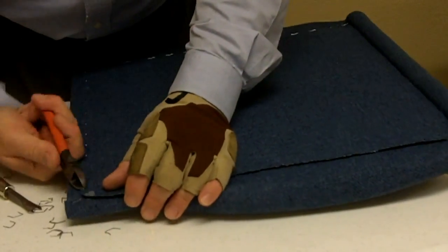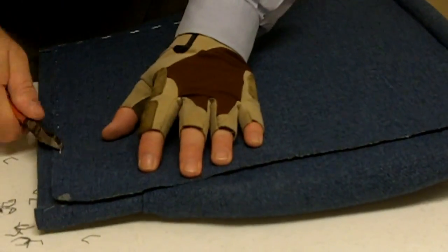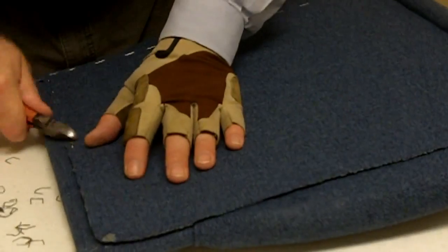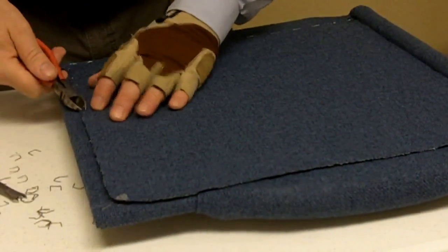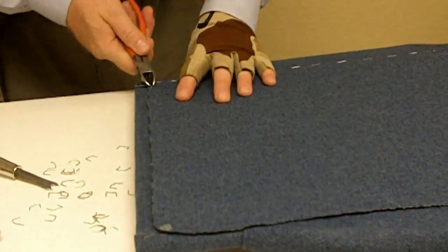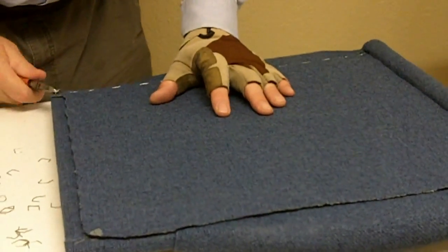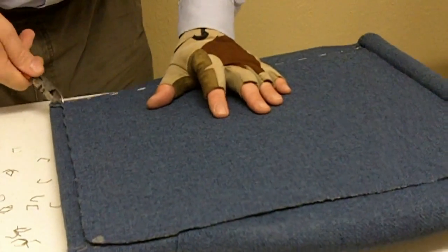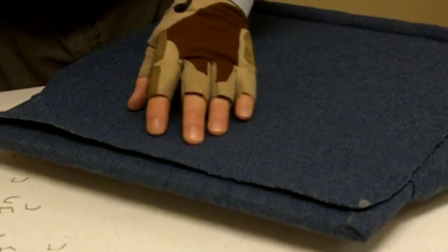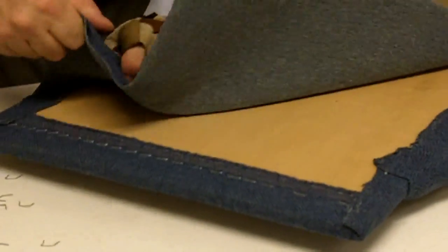All of these staples are covered by the metal straps on the chair when it's put together — that's a real labor saver when the chairs are made. When we reupholster them, we want to be very careful where we put our staples. These are coming out really easily — it must be a plywood back. Some harder woods grip staples much longer and make them more difficult to remove. If the fabric is strong enough, sometimes you can pull the staples loose that way.